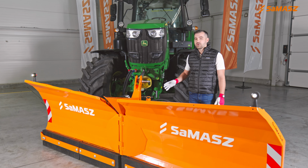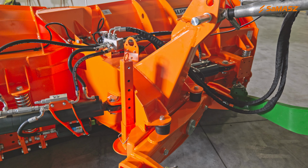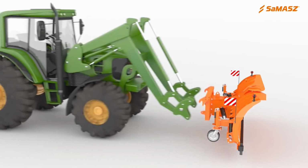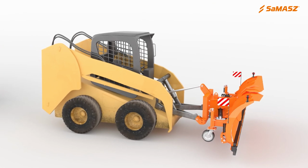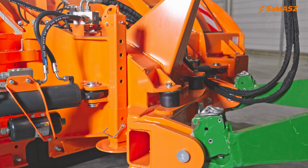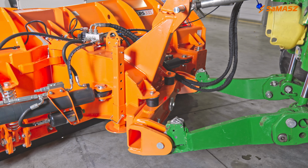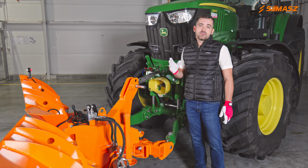Instead of the presented fixed hitch, we can also use a different type of attachment system which uses mounting frames. These frames enable mounting the machine onto various types of carriers, like skid steers, telehandlers, or for example front end loaders. In this specific connection, we have a centrally mounted pivot pin that enables transverse ground contour following for the range plus minus 5-6 degrees.